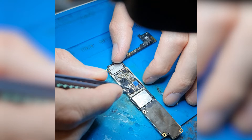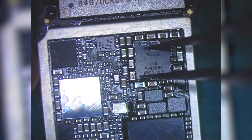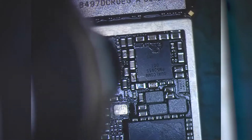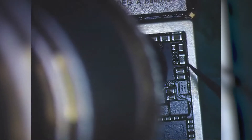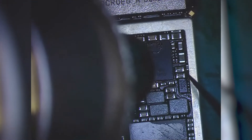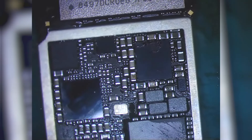Now I'll carefully place the chip in its place. I'm not really applying any pressure on the chip at all. Once it's in its place I'll use the heat gun to heat up the area and the flux will help the chip to its place. I'll tap on the side of the chip really softly just to make sure the chip is in its place.